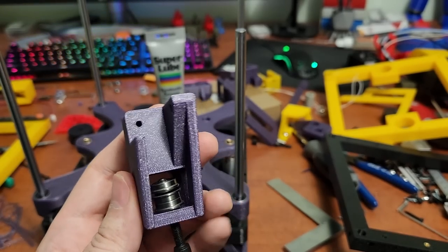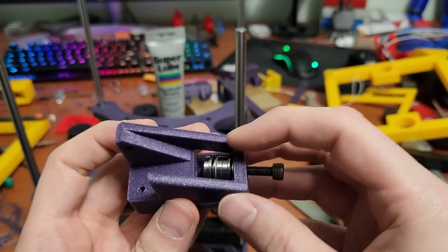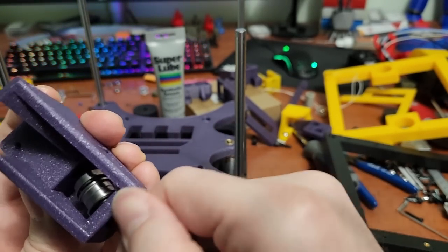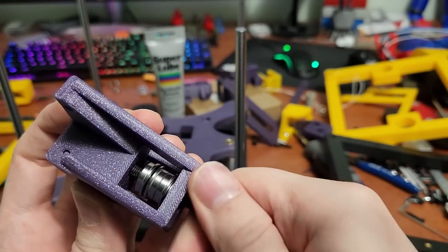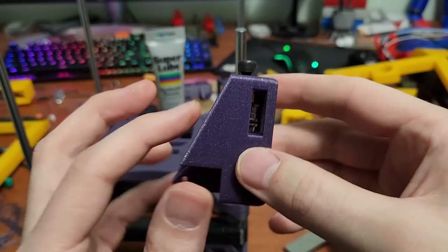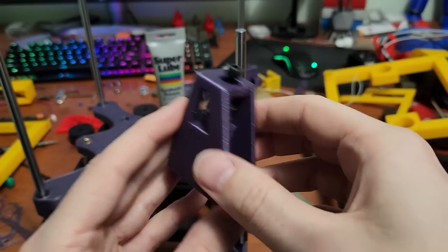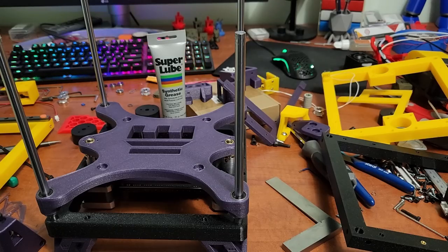These thread into plastic and the hole is quite small so it threads in nicely. Once the bolt is threaded all the way in it's not going anywhere — there's no force pulling up on the bolt, it's just there to hold the belt. I've adjusted this part so you no longer need 20-tooth idlers or those shims.